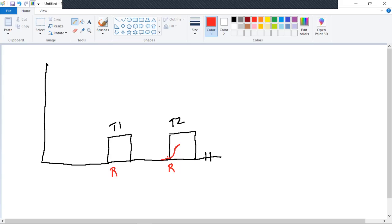If you know the transformer's bad, you might as well just go ahead back one step to the outbound of B and de-energize that cable. There's no reason to have it in here hot to change the transformer out. That's the direction you're headed, correct, Professor V? That is correct. Okay. There's no reason to have it in here energized at all.